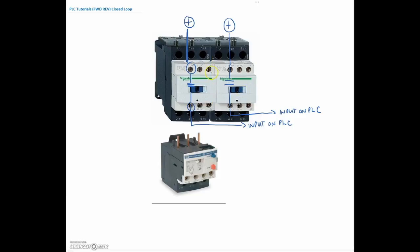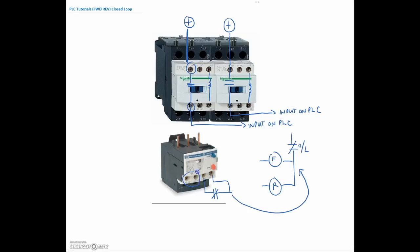On the overload, I've made use of this normally closed contact. I have that in line with each of my outputs - my forward output and my reverse output - and both of those are sharing a common normally closed overload contact. So if this contact opens, then neither of these coils will get current, and that will turn off the motor. But I also need to send a signal, so I'm going to make use of a separate contact on the overload. I'm going to put positive to one terminal there, and then from the other terminal I'm going to go to an input on the PLC.